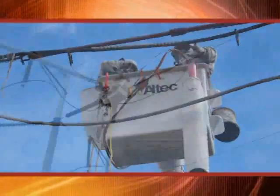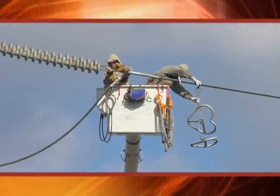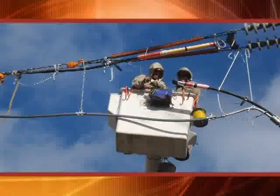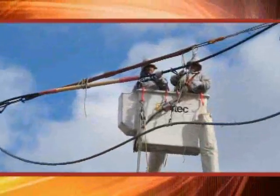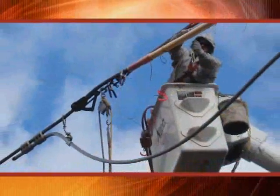Installing implosive splices on an energized situation saves the company a lot of money, because you're saving in congestion charges in the system. We're also able to install more splices per day because of the process of implosion rather than the crimping process, which would take about 45 minutes to an hour per splice where we're doing it with the push of a button. And lastly, there's no grounding and there's no switching in and out of the lines on a daily basis, which saves us probably three hours a day.